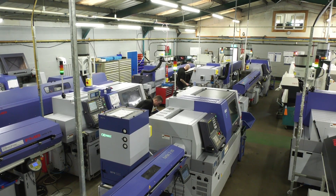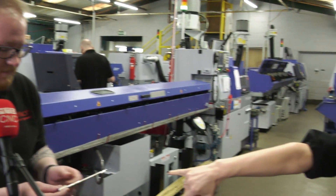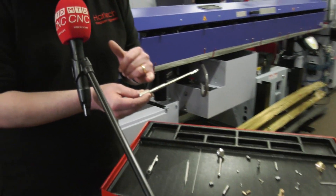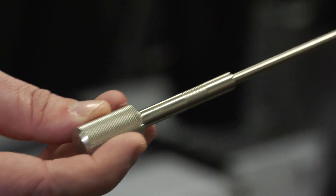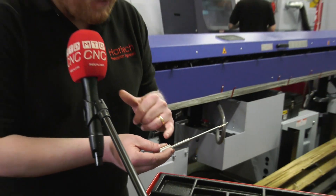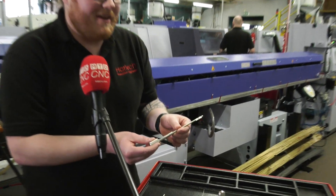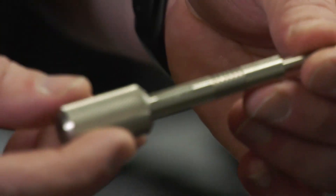It fascinates me — you're getting these off in one operation, dealing with their length and having to use the second spindle. Look at this etching — you've literally got numbers etched into it, it's fantastic. With the support of the sub-spindle, we collect the part and then turn with the sub-spindle, which gives us the rigidity to really turn it in this material. With the support of Star and Esprit we did the engraving on the top end, which was pretty tricky — we got some small tools in there but it lasted fine and did a good run of parts. And there's a great variety of parts — look at the size of these.